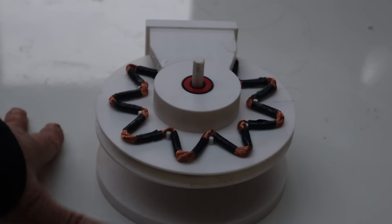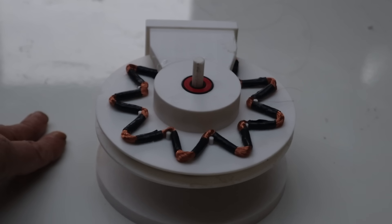With these two coils, the peaks are in the same direction as the north pole passes one leg, while the south passes the other leg. If you join the two coils directly together you would cancel them out - so you can't do that. What you have to do is rectify them first by putting a bridge rectifier on the legs of the coil as they come out, and then you can connect the two in series or parallel depending on what you want.